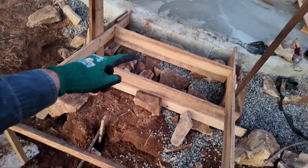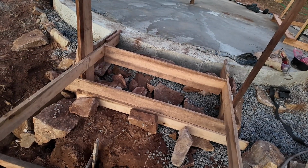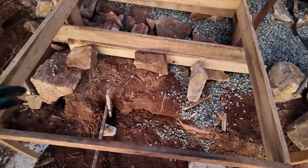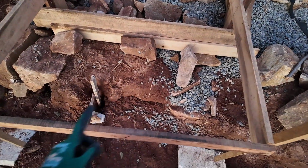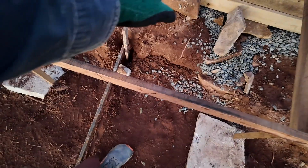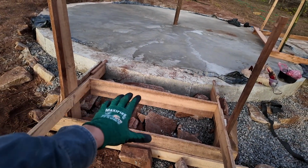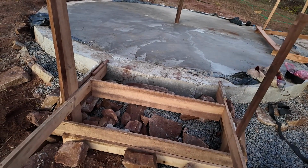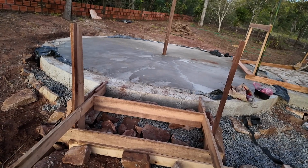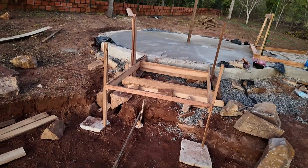Anyways, I think I'll come back tomorrow. I'm gonna pour concrete here, and I'm pretty sure I'll do concrete here also. I'm gonna make a quick concrete form. I put rebar in it so that the concrete that I pour for this foundation will tie into it. That's gonna hold it from moving, because I wanted to put 2 pieces of rebar here to tie this into that foundation, but I don't have a drill strong enough to penetrate the concrete. Tomorrow I might go and see if they sell something strong enough. But other than that, this is probably the most productive thing I did today.